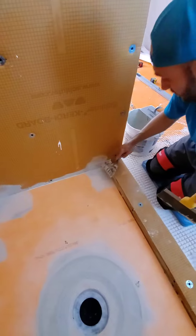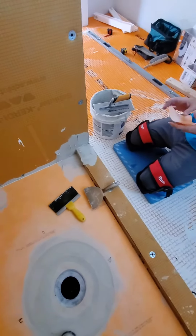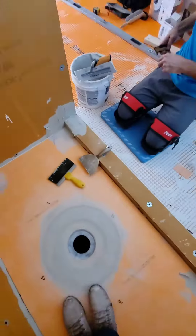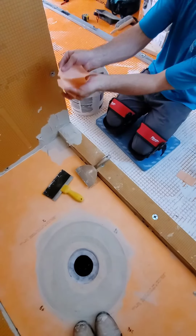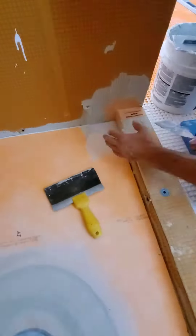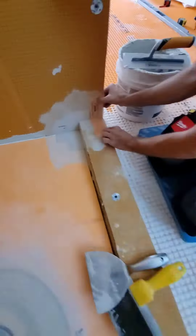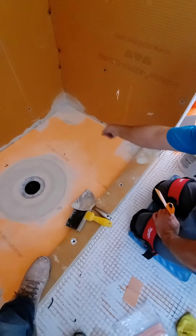We've got the inside corner in. Now we're going to throw the outside corner over the top of that. The outside corner is going to go like that, so I need to cut off a little bit at the bottom. I like to cut a little V in the corner there — you'll see how that V helps the overlap when I start to put it in. And that is how an inside and outside corner should overlap at the curb. Next we'll put in a banding strip there and repeat at every corner — a band in every seam.